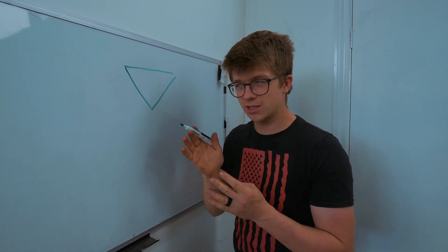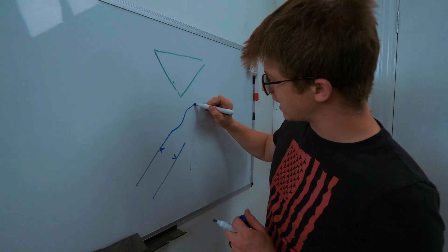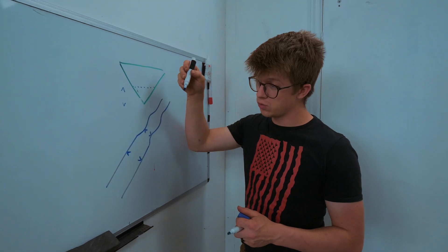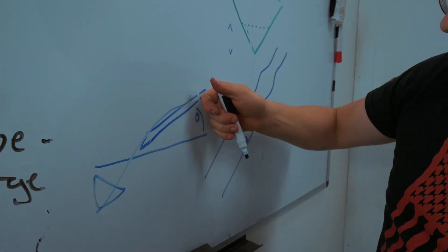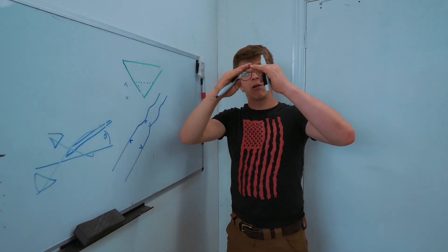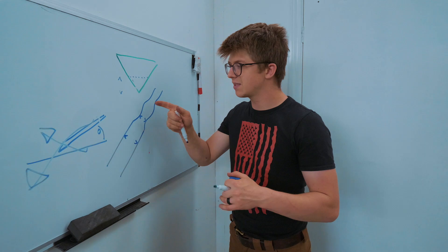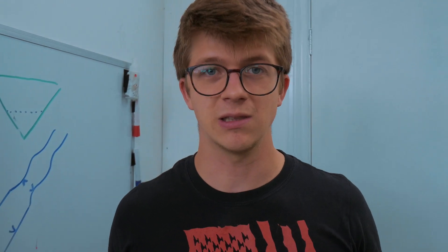Here's why making a nice line is difficult. We're cutting with a triangular shaped tool at about a 120-degree angle. The width of the line and any variations are of course dependent on the depth the engraver goes. How far in the tool goes into the material is determined by the angle at which I'm holding it — if I'm too far up I'll dip it down, if I'm too far down I'll pull it up. That's why my lines are wiggly and wobbly: I don't have the experience, the practice, and the muscle memory to keep it at the perfect angle. Our guard has tapers in both directions — it's not even a flat bit of metal — meaning we need to continuously change our hand angle. If you ever wonder why engraved works of art are expensive, it's because you need to spend a lot of time to get good at cutting small little lines with carbide gravers.